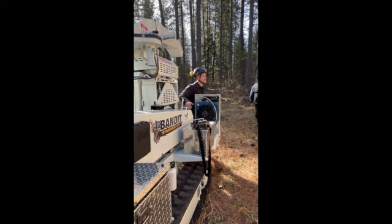And if you guys look on the back side here, you want to step up and just take a peek. You've got a bolt here and then a bolt here. That's simply locking your engine down. So you want to break all 4 of those bolts loose about 2 to 3 turns. You don't want to take them all the way out. They are threaded into little plates. If they come out, it's a little difficult to get back in. Don't ask me how I know that. So break those bolts loose, guys.